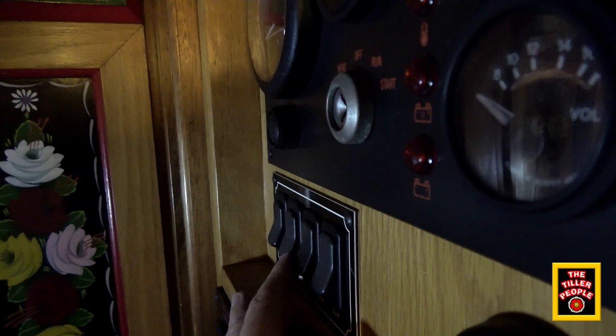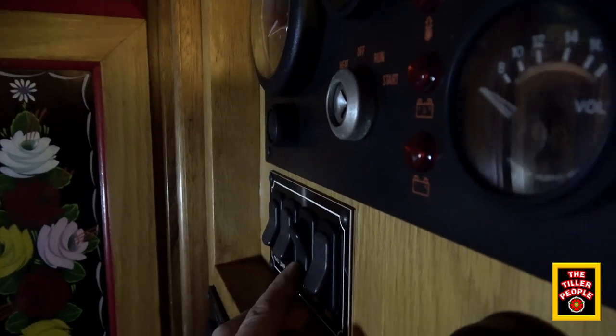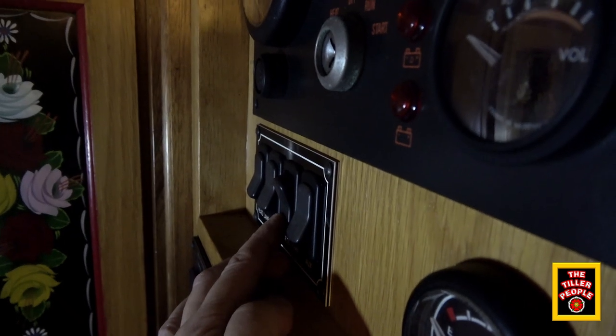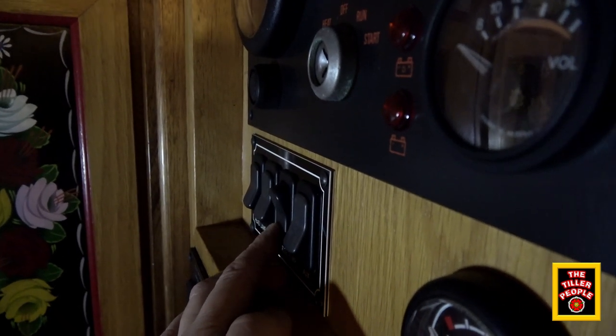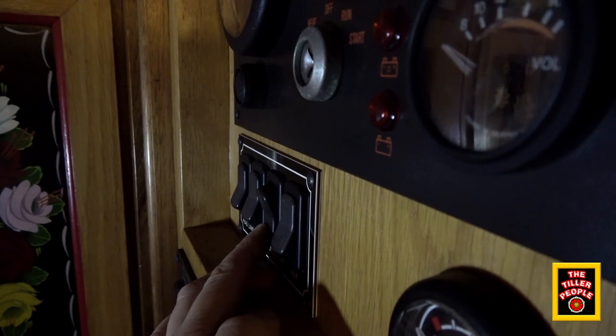What happened with us is, we have what we call an automatic bilge, but you can do it manually as well, by using a switch, what is known as a momentary switch. It means it's a rocker switch, what clicks on when you press it, but you can't stay on unless your finger's on there, so it's manually doing it.